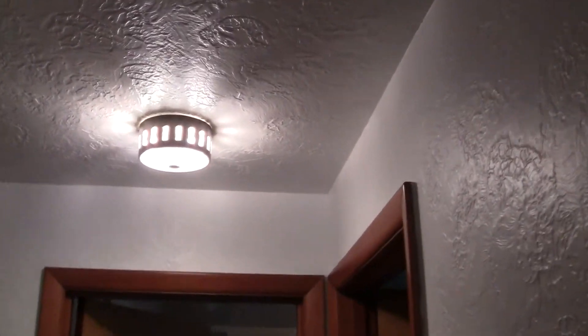Pay attention to the edges right here. This is for all you people that want to do two colors. First thing you do is you paint your ceilings — there are exceptions, but that's really advanced painting. So you paint your ceilings white and you overlap by about an inch down the walls.